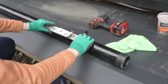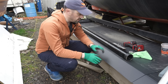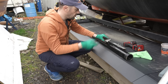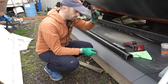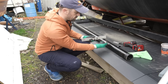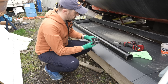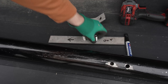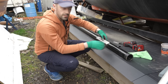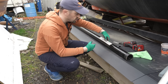You can see why I can't just reach inside all this way to place the bar and bolts through the mast holes. My job now is fitting up these various brackets. This is a dummy representing what will be on the deck, coming out at a 45-degree angle down to where it fits onto the top of the driver's console — that's going to be the main brace. Here I have two pre-drilled holes, and I need to ensure that when these bolts come through from the inside, as they're being tightened they don't rotate, otherwise we'll never actually get them tight. So the plan is to fix them onto this backing plate, which slides down, and that means it can't rotate because it'll get pulled tight against the inside of the tube — hopefully allowing me to hold the whole thing together without welding, and therefore keeping the ability to disassemble later on.